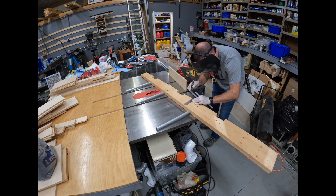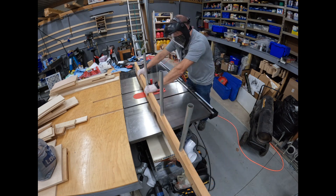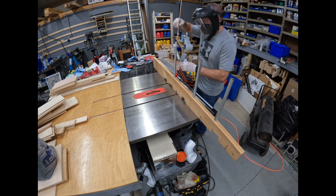The first thing I'm doing: I have my dado blade and a table saw. I mounted a board to my miter, and then I'm just cutting away that section that'll go around that header piece.